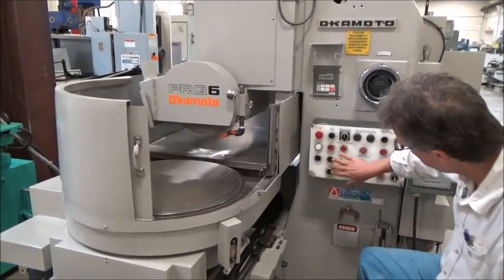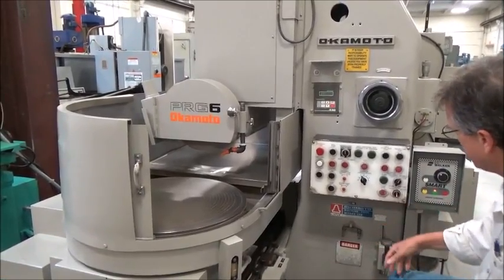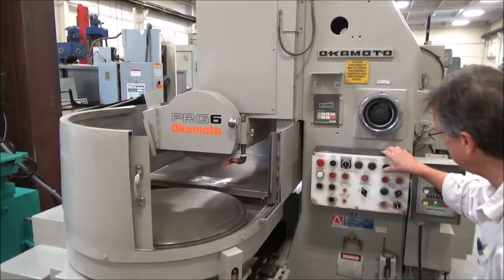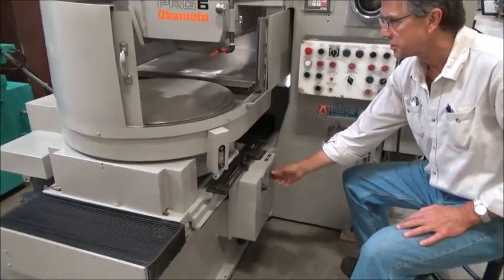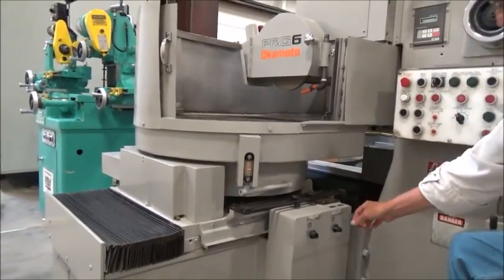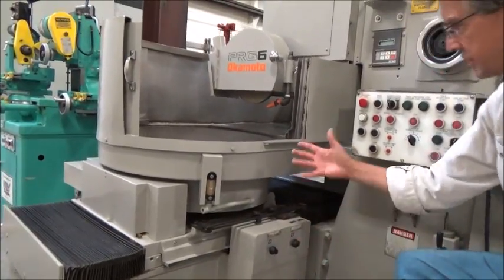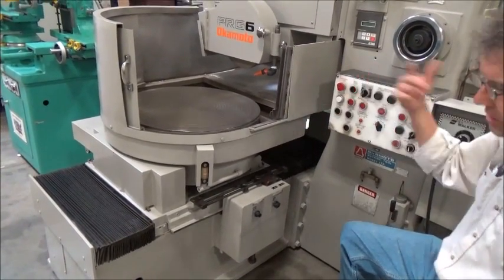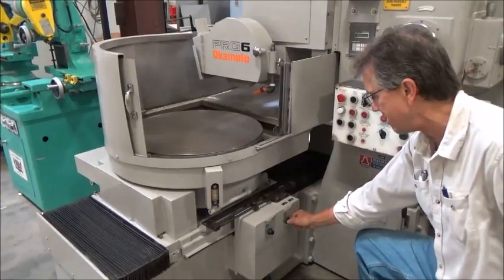That gives me the manual feature. We have table starts — you need a rotary feed. Down here we do have a pot for our table, slow and fast — this is the initial setting. This thing has a constant speed control built into it, so no matter where you set this, as it traverses it speeds up and slows down for constant speed grinding. You might be able to hear it slow down and speed up as we're traversing, but we've only got a little three-inch pass here.